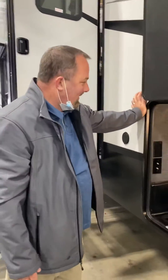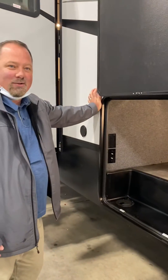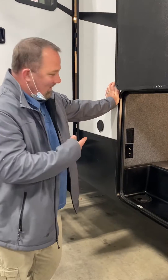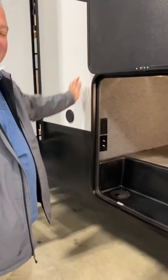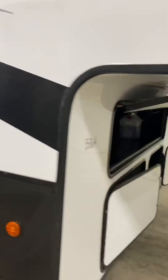So Trevor, why don't you tell us why it's important to have it set to lithium and 12 volt. So if we don't change that — if it comes set to sealed or gel — when the battery dies and it's not set for lithium, the battery will not wake up. When it needs to wake up, it goes into protection mode. This battery down here will be in protection mode.